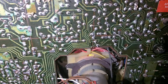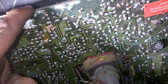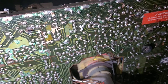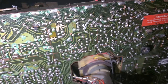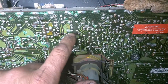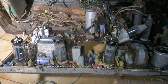I don't know how I missed this but the board is completely cracked all the way from top to bottom, and it goes through a whole lot of tracks. I got a beer and thought about it, and actually had the patience to scrape off the copper traces and tack some solder blobs all the way to the top. Everything is making contact now - at least I think so. Not a proper repair, just for testing.